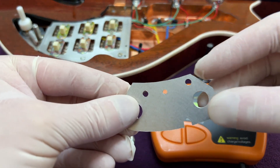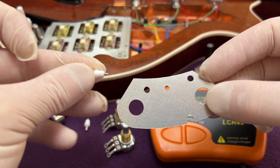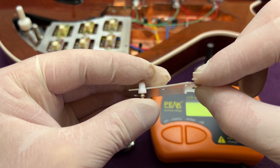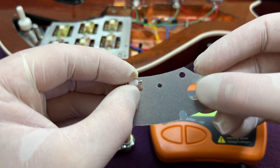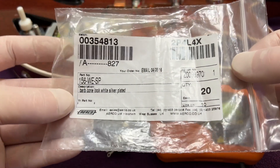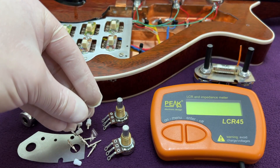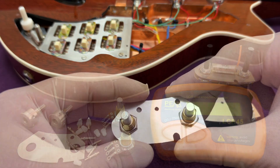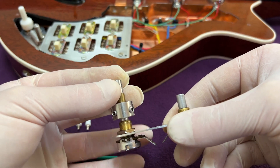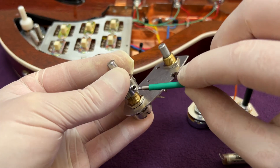If you examine the picture of this assembly in the Red Special book, you can see that Nigel made some further improvements to Brian's original configuration by fitting military specification insulated terminals. Oxley Development designed this barb-cone lock technology, which uses an elastic PTFE sleeve, allowing the silver-plated barbed metal spill to lock itself in place by gently expanding the PTFE underneath the chassis during insertion. Because these Bourns potentiometers have short plain shafts, extenders were required. Nigel had custom stainless steel versions made, which attach via two M4 grub screws.